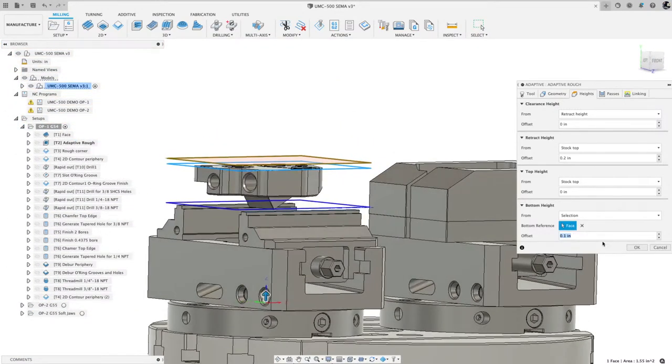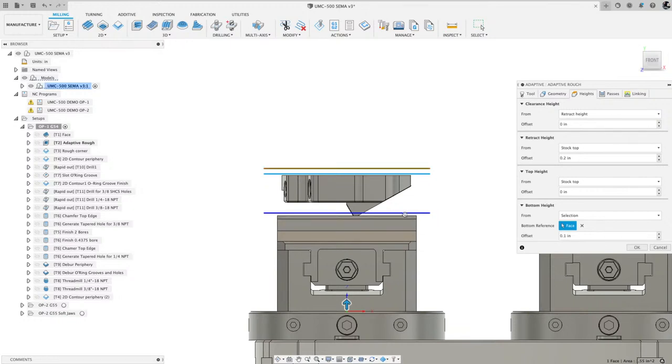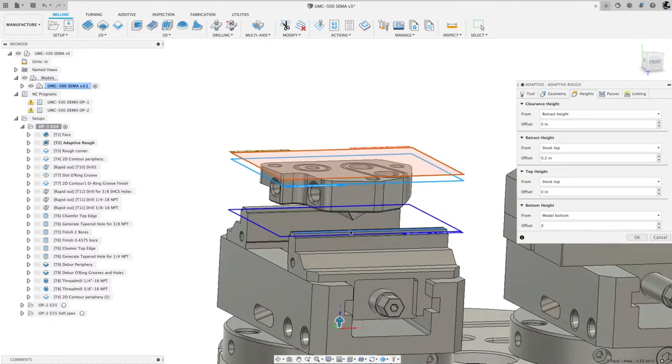So by selecting that, I'm guaranteed that when my tool goes to that depth, it won't hit the part, it won't hit the jaws, I should say. If I had this based off the model top or the model bottom, then depending on where the part sits... So if I just say model bottom here, and if that value was zero, you can see that blue line moved below where the jaw is. And if I hit OK,